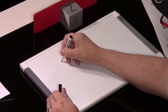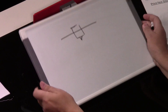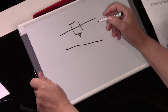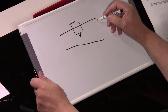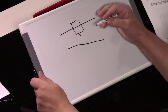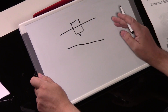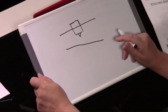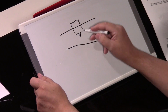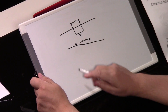What I mean by that is you may have your gantry perfectly level to the frame, but for whatever reason your bed is askew. One of the two things that can happen is that the gantry itself may not be square to that bed. First and foremost, you want to make sure that you level the bed. This is kind of a continuation of that — you might get great adhesion on one side but not the other because it thinks this is level.